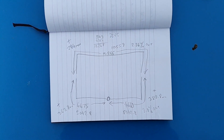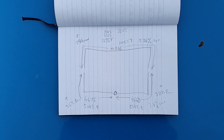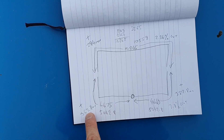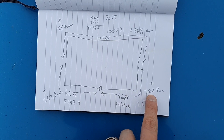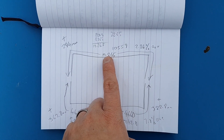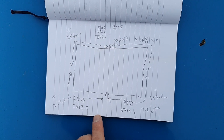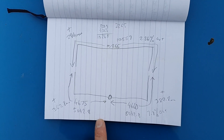I think I've sussed out why we're so far out — it looks to be a major schoolboy error on my behalf. I've basically constrained the ends with those little aluminium carabiners so each corner wire couldn't spin round on itself, and by taking those cable ties off I was able to get a little bit more slack. Looking at the feed point side: it measured 4675 mm but it should have been 5042 mm, so I need to add 367.8 mm. On the other side I need to add 382.8 mm. On the big single piece at the back — the reflector — I measured 10265 mm and it should be 10559 mm, so I need to add nearly 300 mm. It certainly pays to measure twice or three times and cut once.